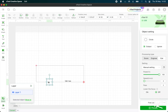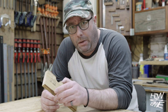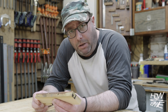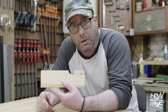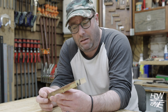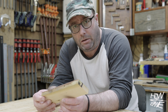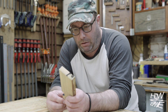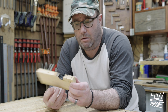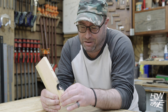Let's try that again but with three passes. To say I wasn't expecting that is an understatement — that's three passes, speed 4, power 100. The entry cut is pretty nice and clean but the exit side is like a ripped-out fireplace — but still not bad, is it? It's 18mm thick. Couldn't do the MDF at all with 10 passes, but that first cut in pine is almost through at three passes. I'm really impressed with this laser.